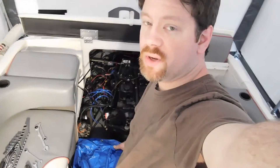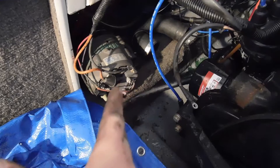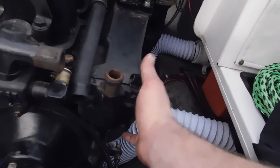I've got to pull the head off, check it over, and see what I can find — I pray it's a gasket. A couple things to know: if you have a nice interior or just care about your boat in general, I suggest laying down a tarp to keep your carpet nice, and maybe cover or remove your seats. So far I've removed all the hoses, drained the manifold and engine block, and removed the alternator — less wiring to have to figure out. Now I'm going to work on removing the valve cover followed by the intake and exhaust manifold, which is combined on this engine.